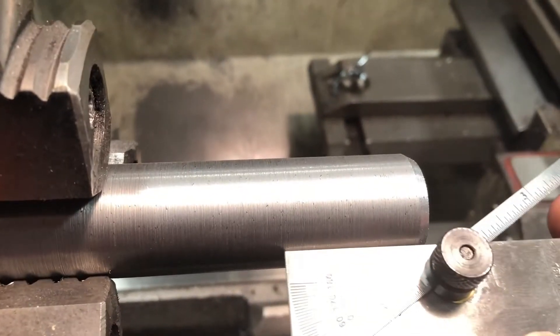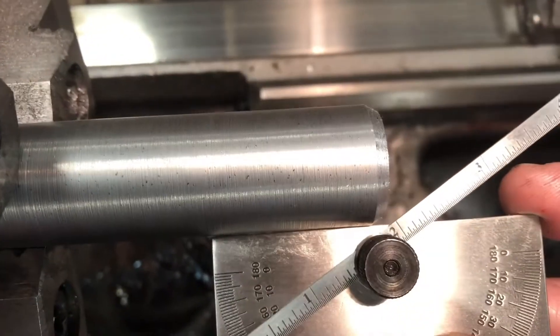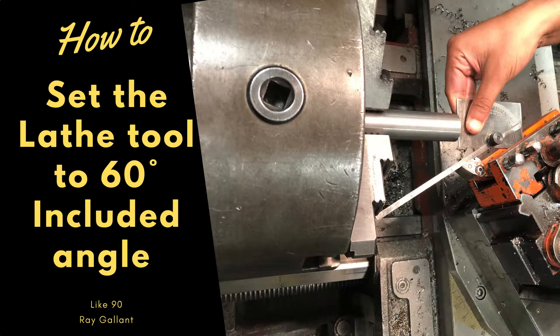I hope you enjoyed this video. Don't forget: you must move in the Z-axis 150 thou. If you move in the X-axis 150 thou, you will not have the proper depth on a 45 degree. You can move in your X or your Z-axis. Also don't forget to like and subscribe, thank you.